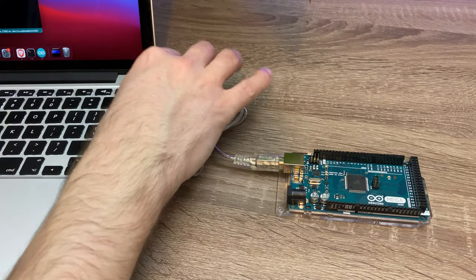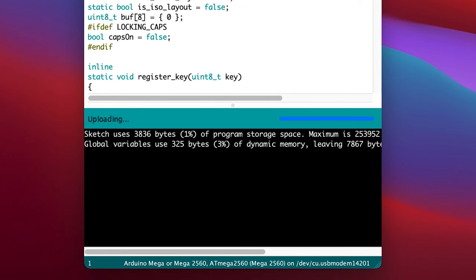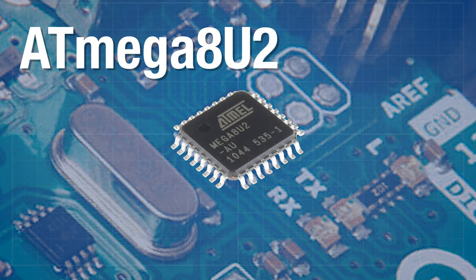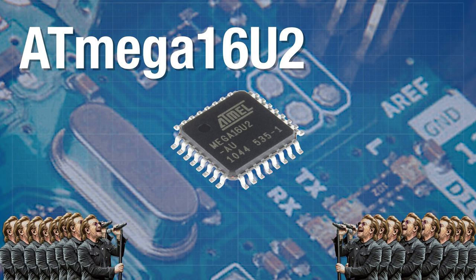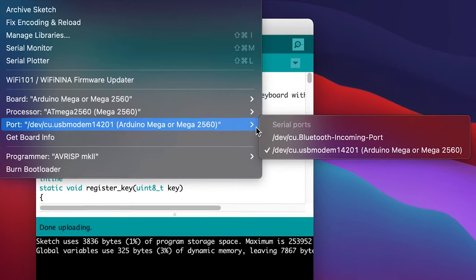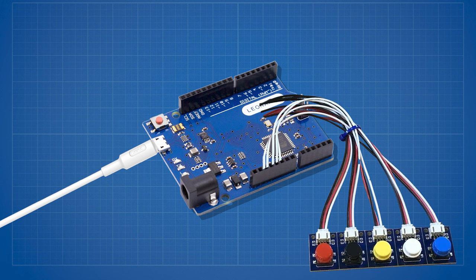When you connect an Arduino, it also knows what it is — it shows up as an Arduino with a USB to serial converter, and that's what's used to write the code to the chip. Starting with the Arduino Uno, this was done with a programming chip, the ATmega 8U2 or 16U2 depending on the model. This is essentially a second microcontroller that contains the firmware for the USB to serial communication. A later model, the Leonardo, had a microcontroller with built-in USB communication, meaning it could act as a virtual serial port as well as a human interface device, which for what we're doing would be absolutely perfect.